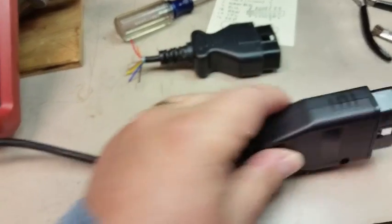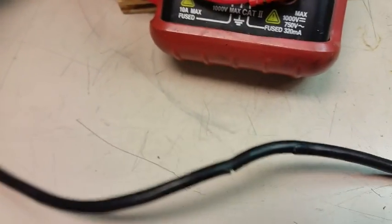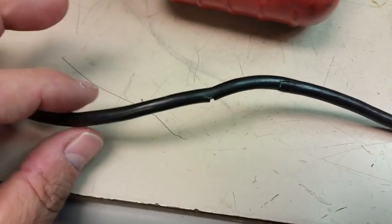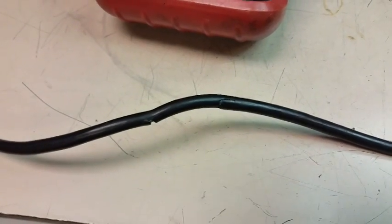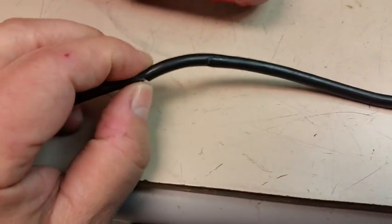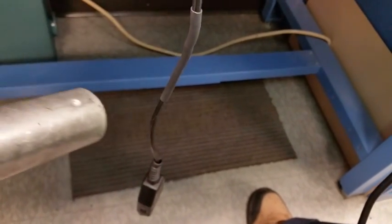If you've got bad cable jacket problems like I do, go ahead and get your heat shrink and put it on. There are two ways to do this: you can just shrink it on and be done, or you can put some epoxy around the ends before shrinking so it seals out moisture. I'm not going to worry about the epoxy since the connector isn't sealed internally anyway. I'll just put my shielding on here, then heat up the heat shrink and shrink it down.